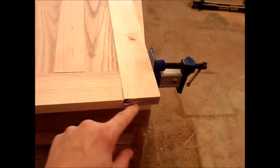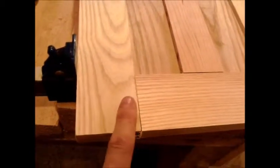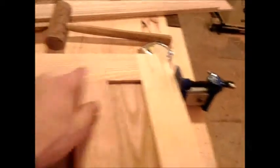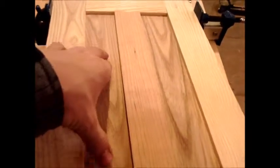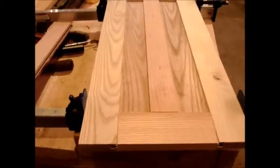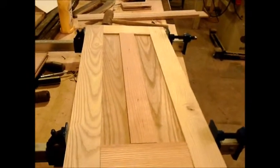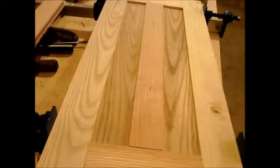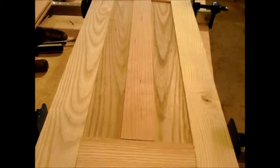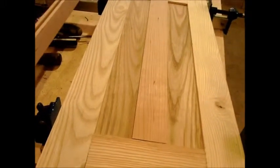I'll also hide those dados from when I cut the panels so they fit in. These panels aren't going to get glued together — what's going to get glued is this piece, glued and doweled onto the adjoining pieces at multiple points. The panels should stay free-floating so they can expand and contract. It's about 8:10 right now, so I'm going to go in. I'll probably have the next video up within a couple of days — my internet is horrible, deplorably slow at uploading. A 10-minute video takes me anywhere from 8 to 14 hours. So I'm going to cut it here.